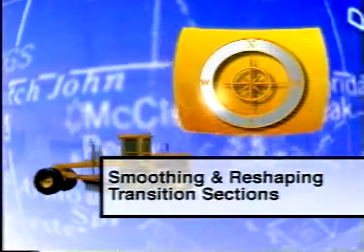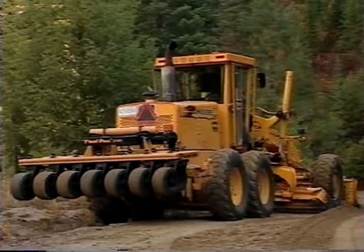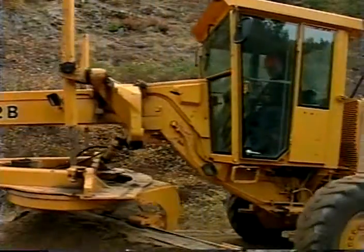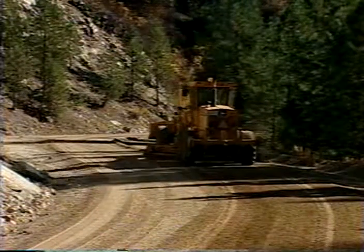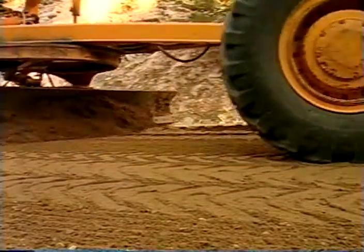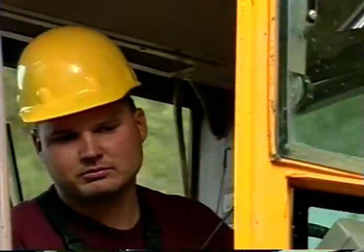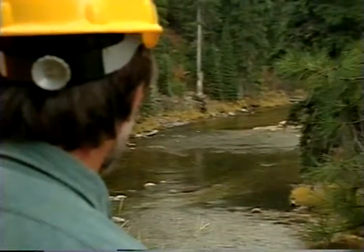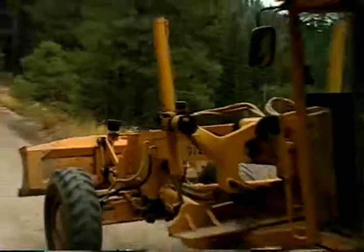Occasionally, you'll need to maintain roads that include a combination of in-sloped, out-sloped, and crowned segments. In this situation, take special care with the transition sections between the different segments. Decrease your speed to allow smooth, accurate transitions and prevent irregularities. To ensure driver safety, the length of the transition must be maintained to the design speed of the road. By correctly and promptly smoothing and reshaping roads as their condition requires, you not only fix imperfections in the traveled way, but you actually design longevity into the road. Being vigilant and selective in the upkeep of roads assures their durability and usefulness, while protecting the surrounding ecosystems.